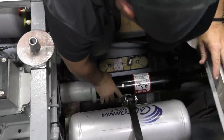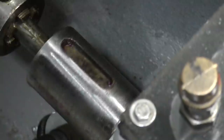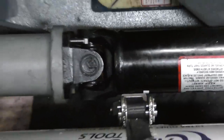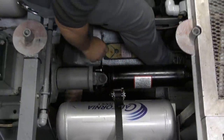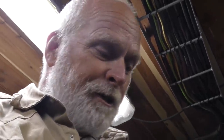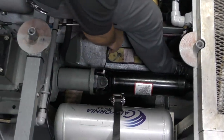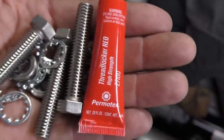I'm going to let Dustin do the work here. So we've discovered that the bolts have loosened up from that drive shaft coupler — this is the second time they've done that, so we're taking some precautions. It's always a good idea to go around with a wrench and just tighten things up to make sure they're still tight. Those were not.